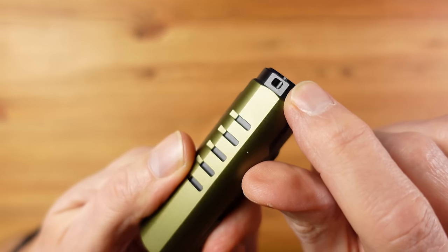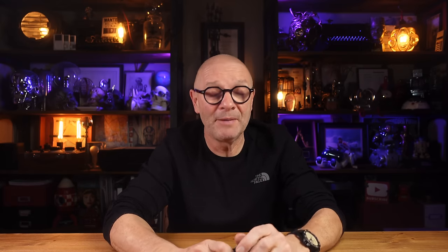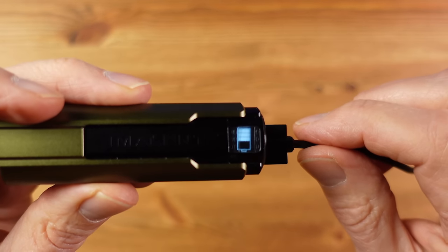There's no pocket clip, but there are a couple of holes to attach a lanyard. The maximum output is a significant 4000 lumens, though like all lights here that high output lasts under a minute before stepping down, so it's for intermittent use. It uses a single XHP 70.2 LED — the kind seen in very high-output array lights — powered by a fixed 18350 1100 mAh battery, the same as the Wuburn, charging in around one and a half hours.